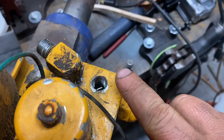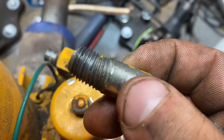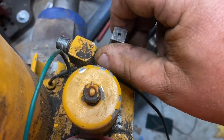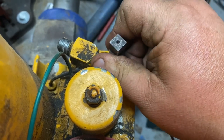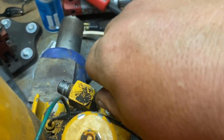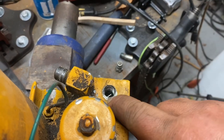So I cut that piece out with the hacksaw. When I did, I had this laid upside down — that way no shavings can get in there, though these are very easy to flush. Upon inspecting it, looks like it just stretched the thread there, because this doesn't look torn. We'll see what the tap says. Very good. No wiggle to her. We are good to go. If it does fold up or tear the upper part of the metal, what I do is put a pipe nipple in there and then peen two rows past it. I've had a lot of good luck with that.